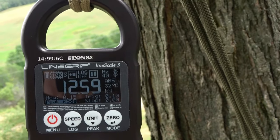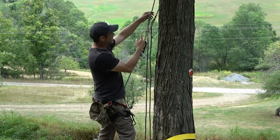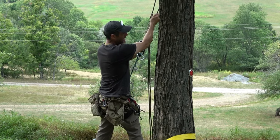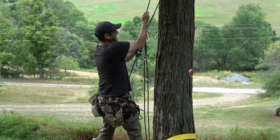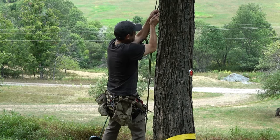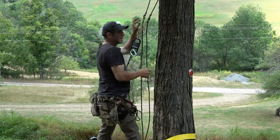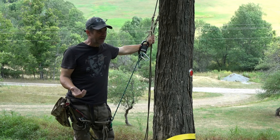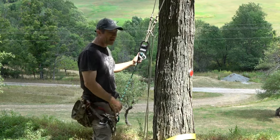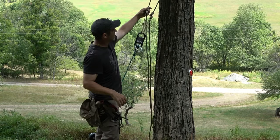I'm going to put the camera back on the tripod and see how easily they move. With 12.59 kilonewtons on the friction hitch — the weight of six people on each side — I would expect them to be somewhat bound up. I'm able to move this one a little bit, and I just was able to break that free. They are a little bound up. In order for this kind of load to be exhibited there would have to be a catastrophic failure, like a fall. I'm going to loosen them up and rig this again with better geometry and pull until we actually get movement. With a little wiggling we're able to get these loose and moving.